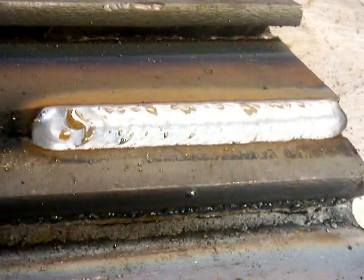Okay, this week we're gonna talk about a little technique for vertical MIG welding, vertical uphill, that is. So this basically amounts to a series of triangles. It almost looks like I'm making little circles here, and actually might be, but in my mind I'm making a triangle where I'm cutting across the leading edge of that puddle and straight across, and just progressing up a little bit. And the way I'm progressing up a little bit is I'm making sure that the arc comes across the leading edge of the puddle each time it passes across.